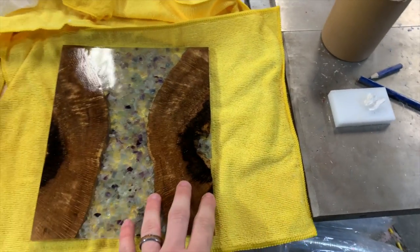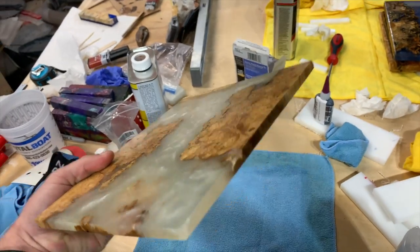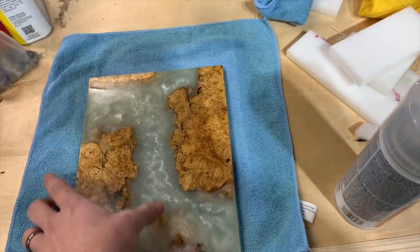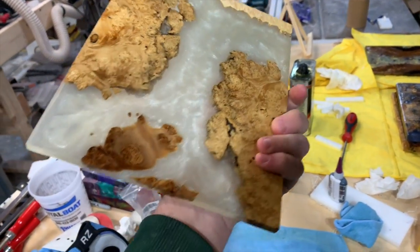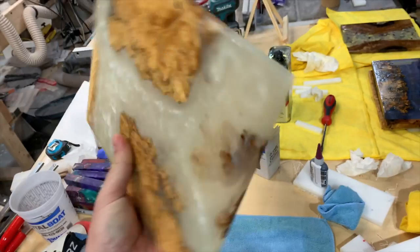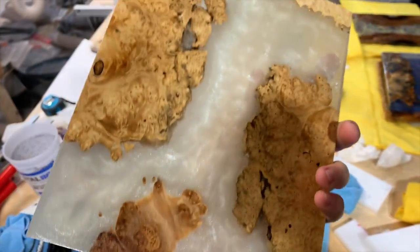There's a little wobble to one side of the stone board because of the curve, though on the other side there's no wobble — it's fine as a cheese board. The spray-finish board turned out really well. I ended up getting it a bit too thin on the planer trying to flatten a slight warp, but it doesn't wobble. The small piece of maple was the only stabilized piece across all these boards, and it was so easy to finish that section — I wish I'd stabilized everything.